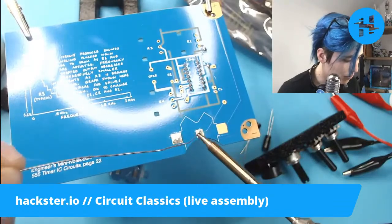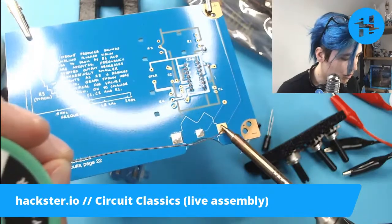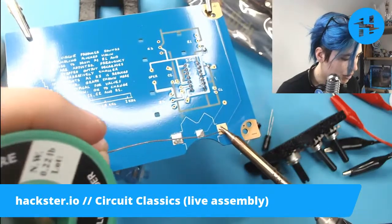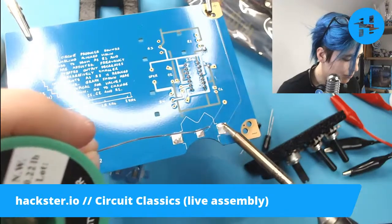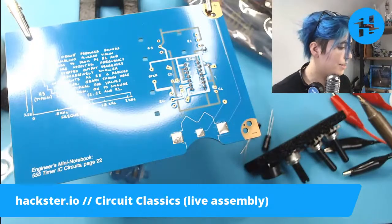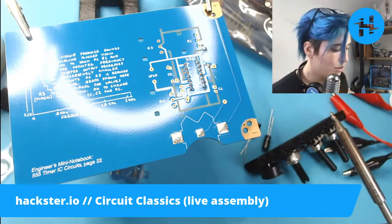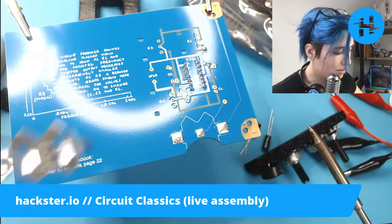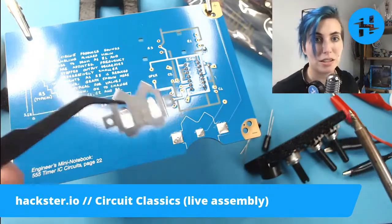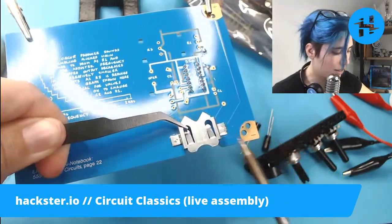That's honestly as much of a physical thing as it is an electrical thing. It sort of pushes against the coin cell. Come on. Lead-free solder is always a little bit more finicky than leaded. So I've got my tweezers here, which I'm going to use to apply this, because this thing is basically a giant heatsink. It's going to get very hot and I don't want to be holding that with my fingers, but I do need to hold it in place.